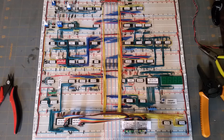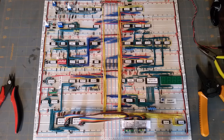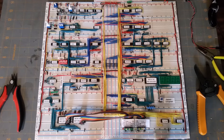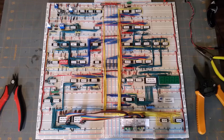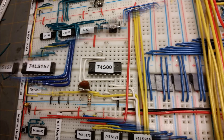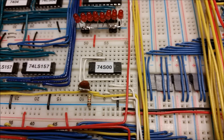I'll save that for part 7. I've been following the comments left on Ben's videos, and I feel fortunate to have not run into the issues that some of the others have reported. About the only thing I've changed is to isolate the RAM-IN plus clock control signal. I don't know if it was necessary, but while I was creating the inverted clock for the T-State counter, I figured — what the heck.